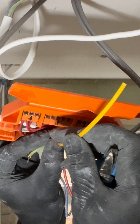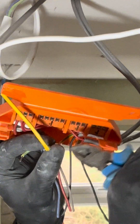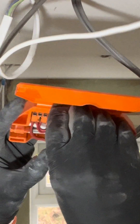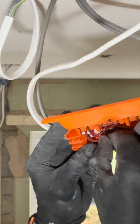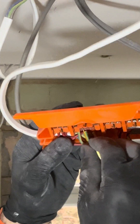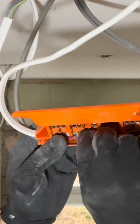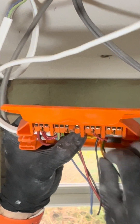Like that, and then this earth sleeving on in here. So then we'll open up four of these — we've got four cables going in, which will be four earths. CPCs — same thing. So that's one in there. When you put them in, if you're not sure, give them a bit of a tug to see if they come out. It doesn't come out — so that one in there nice, and that one also in there nice, and that one — perfect.